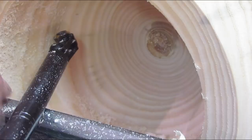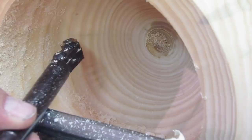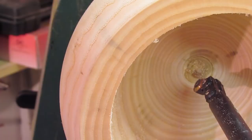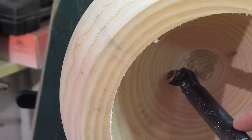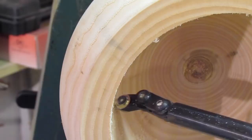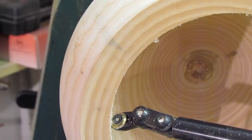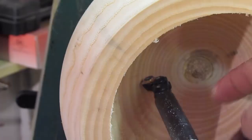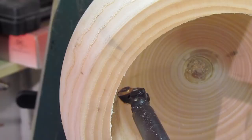Because I've got the camera just to the right of my shoulder, I'm unable to get the tool over, so I'm going to move the camera and explain that. As I'm cutting with the tool, I start off with it perpendicular to the base — the tool handle running straight through the spindle axis of the lathe. Then as I cut around, I use this fulcrum point here to move the handle around. What I'm doing is keeping this cutting edge as much as possible perpendicular to the surface. As I come up the wall, I pull the cutter out if I'm hollowing and keep it cutting on the sweet spot. If I keep the tool parallel to the spindle axis as I come up the wall, the cut runs right up around the left-hand side and will be supported less by the tool rest, giving more twitching and less efficient cutting.